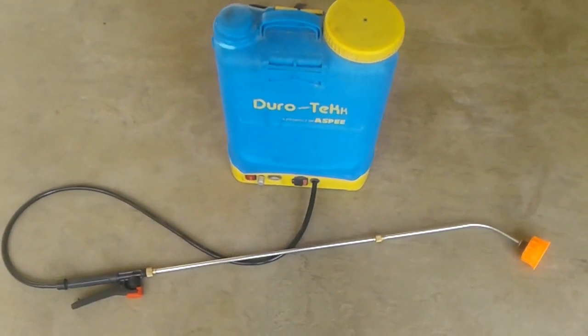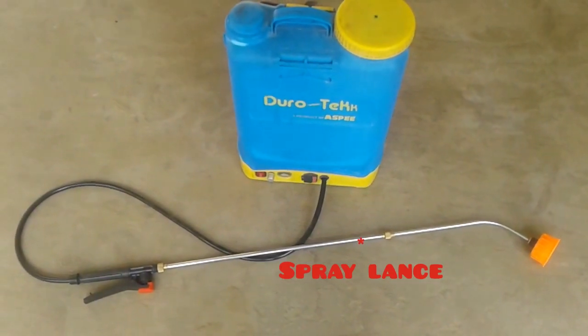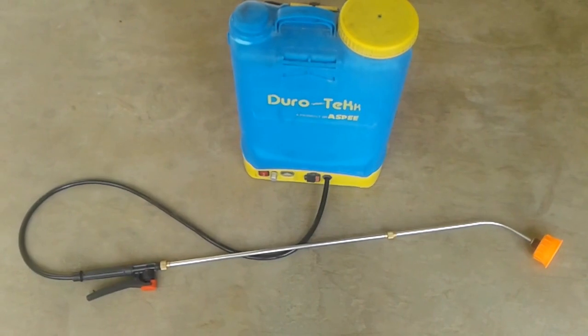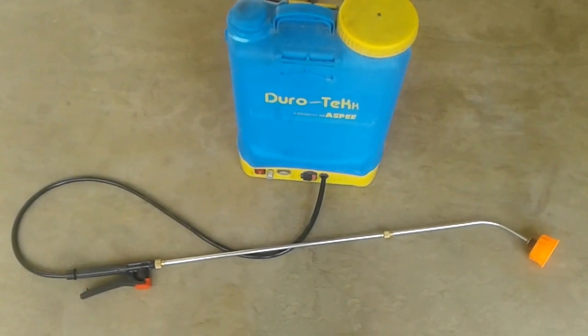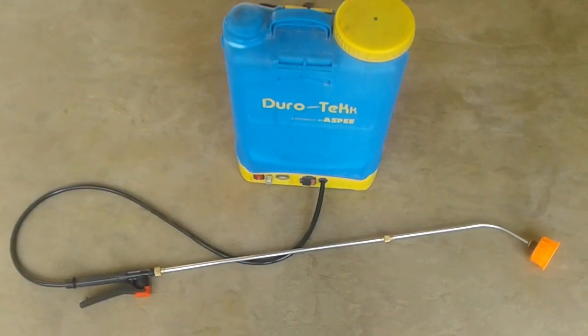The delivery hose is also connected to the spray lance. The lance length can be adjusted, for example from 100 cm down to 50 cm, to find the minimum comfortable length. The spray lance is made of stainless steel, similar to brass. If not maintained, it will start to leak.